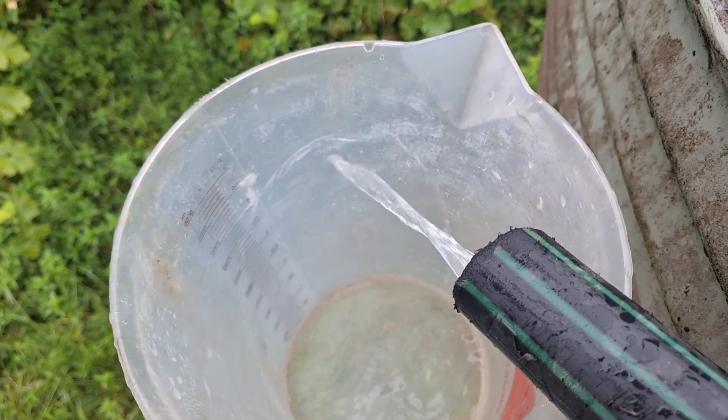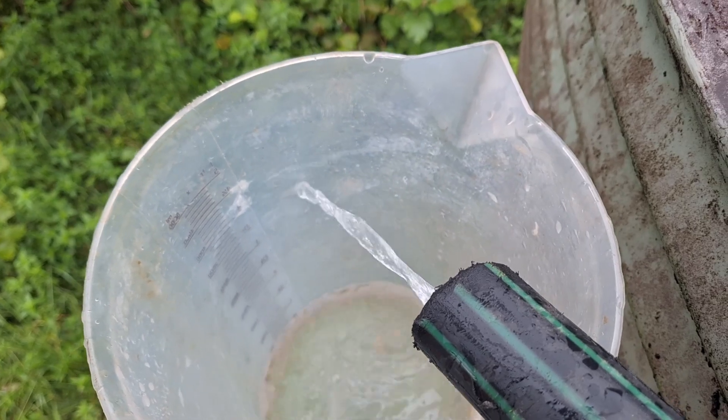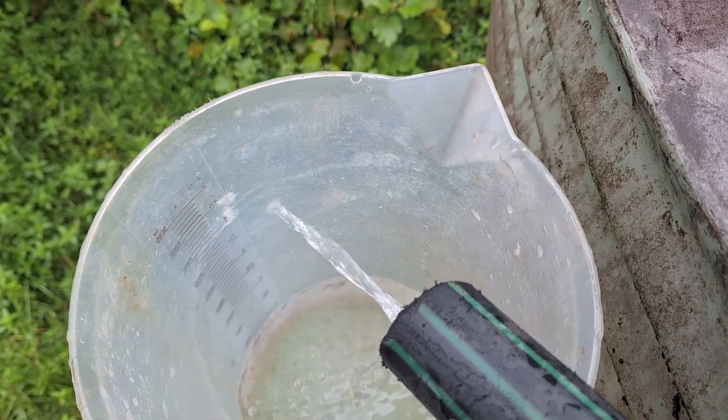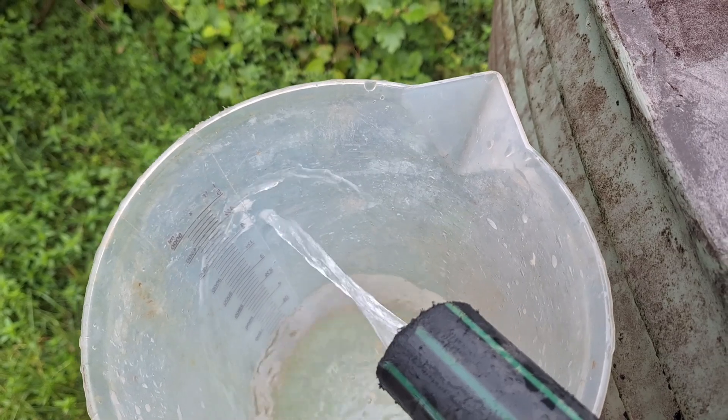So this is the output for this Bunya Pump, the PA-13, in the Tully area. Working off 0.8 of a metre fall, pumping up to a 37 metre head, and the output is around 3.8 litres a minute.